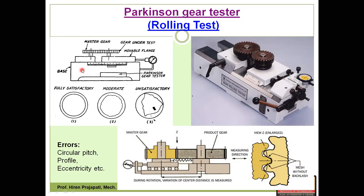In this schematic arrangement, this is the bed. On the bed we have 2 carriages — one fixed carriage and one that can slide to and fro on the bed. Two vertical spindles are given, and on these spindles we arrange 2 gears: one is the master gear which is error-free (our reference gear), and the second is the gear under test. The rolling test gear is fixed on the floating carriage, which is spring loaded against the fixed carriage. The spring is visible in the schematic diagram and always maintains continuous positive contact between both gears.